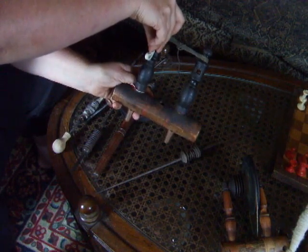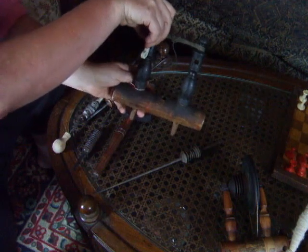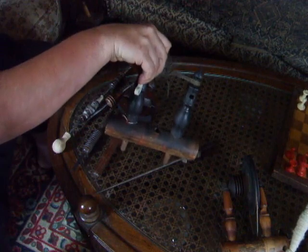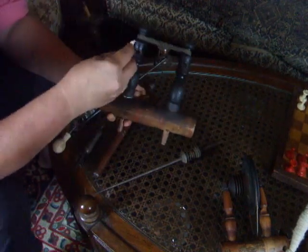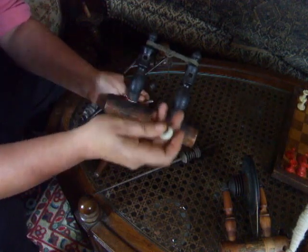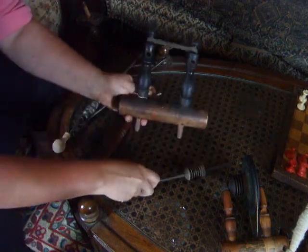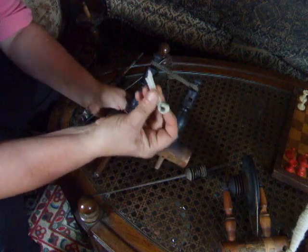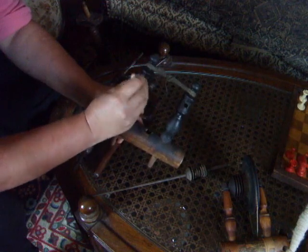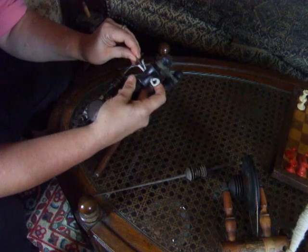The tied-on bearings were often of corn husks, and it's an attractive way to do it. Notably Granny Childers of Kentucky swore by the corn husk bearings, saying that they were faster. When you're attaching a direct drive spindle for the great wheel, if you aren't tying it on, use a piece of leather, put it through the holes, and then turn around and put in a wedge. This keeps the spindle from returning.